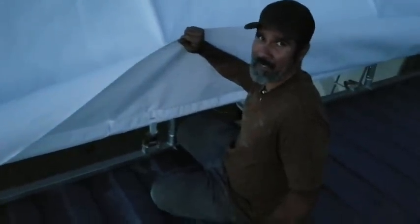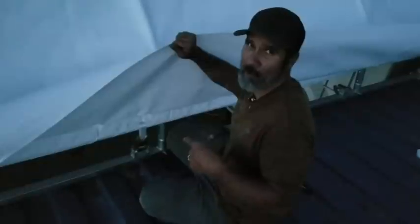And then we'll even the straps out. And then we gotta put it through the ratchet. You can ratchet it a few times. And this is what's gonna hold the tarp. And this is how you adjust the tension in the tarp. So we have to do this all the way down on both sides. And then the very last step is going to be to lace the end of the tarp so that it's all finished. So we're going to continue on down the line, then do the other side, and then that'll be it. It'll be complete. So anyway, peace out. We're going to continue off camera this part.